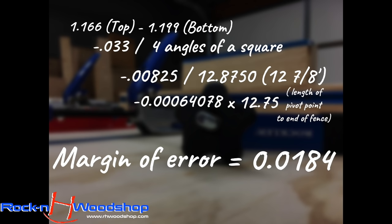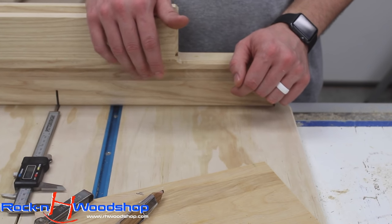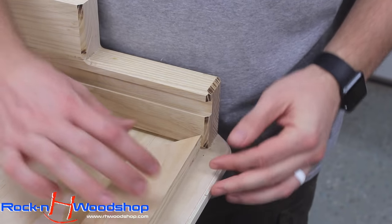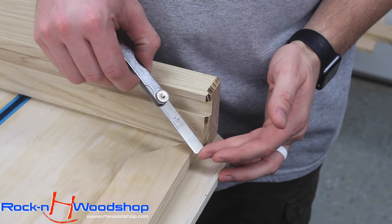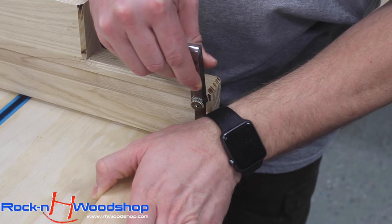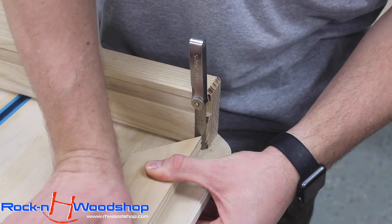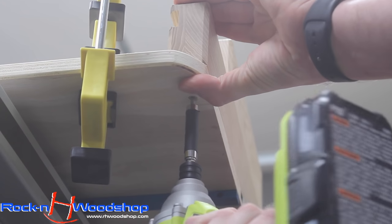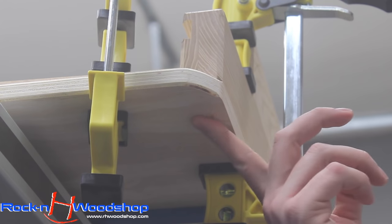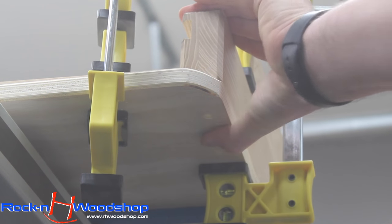When I did my calculations, the number came up as a negative, which tells me my fence needs to go forward. A positive number would mean moving it backward. To begin, you need to find an 18-thousandths shim — if that's your measurement — and slide it in between your reference piece, because you need 18 thousandths to move forward so you have to put something in the way. Push it up snug to the 18-thousandths shim, take out the original screw, scoot the fence forward into your reference point. Because the hole we made previously was set for the old alignment, we don't want to reuse it — it would just pull the fence back — so we need to make a new hole.